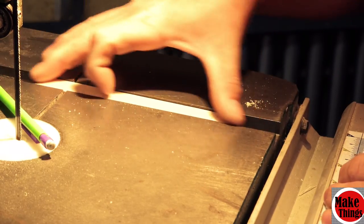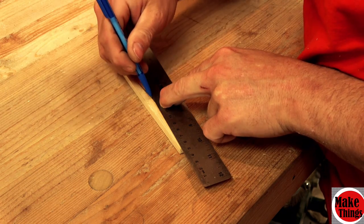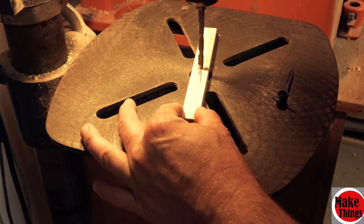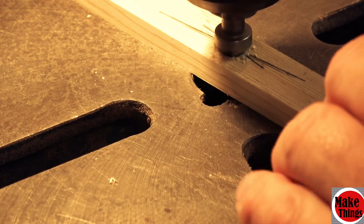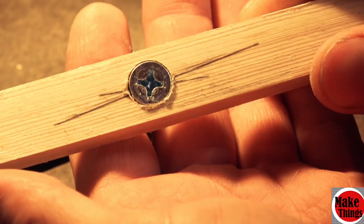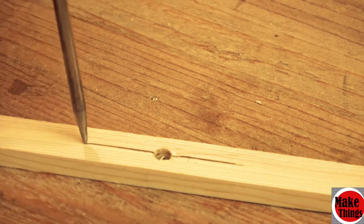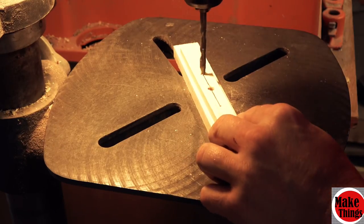You'll want it to slide without any difficulty. Find the center of your expansion bar by connecting diagonals and drawing an X, using an awl to mark the center. I use a ¼-inch drill bit as it fit the bolt size of my knob, and then a fluted countersink bit so that the cone end of my bolt will fit flush with the expansion bar. It's important to cut out a slot here as well as drill a couple of holes to allow expansion, which I brought back to my ¼-inch drill bit.